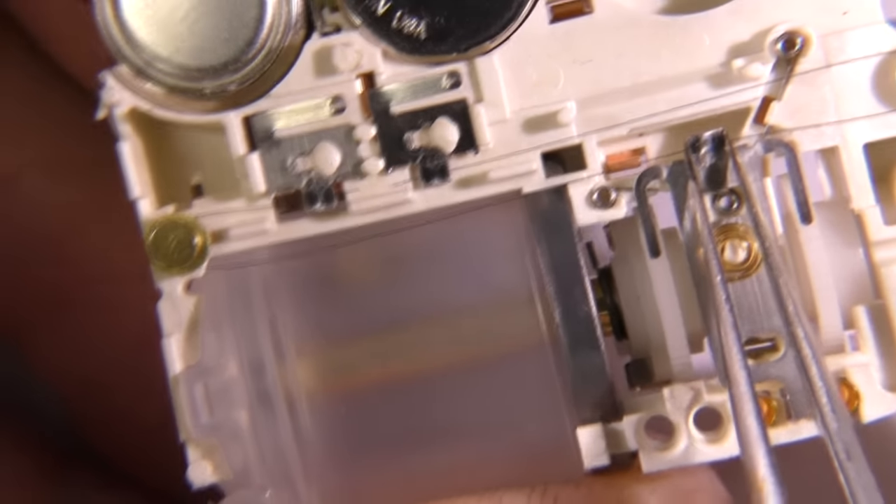So this is now in its ready-to-pump mode. Each time this moves side to side it just clicks, and you can see it's rotating those wheels. At the end there are contacts so it knows when it's hit each end — it activates the muscle wire until it sees that contact being made, then turns it off and actuates it the other way. Probably each stroke represents a certain amount of insulin, so it starts one at a time if pumping a small amount.